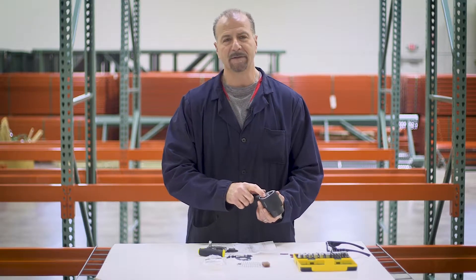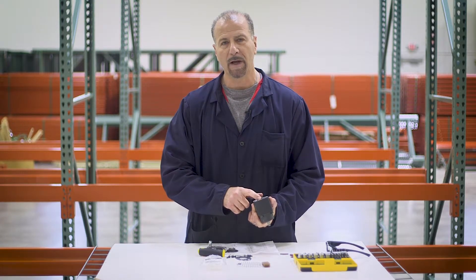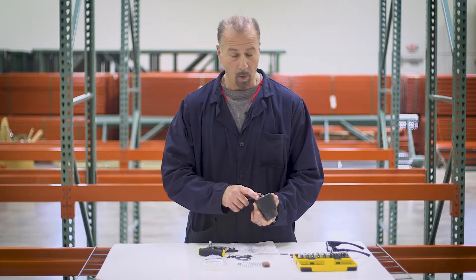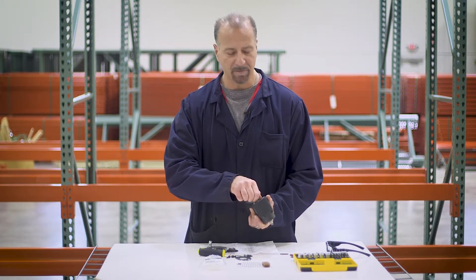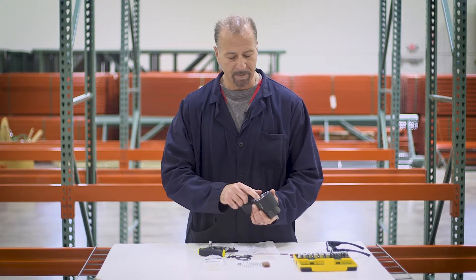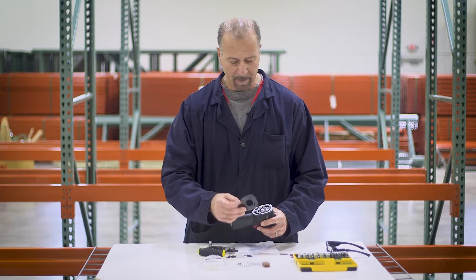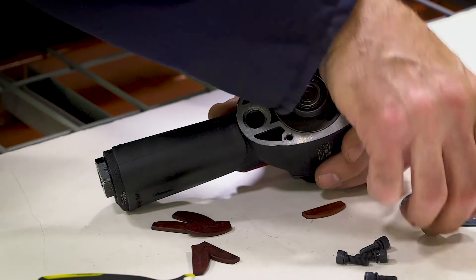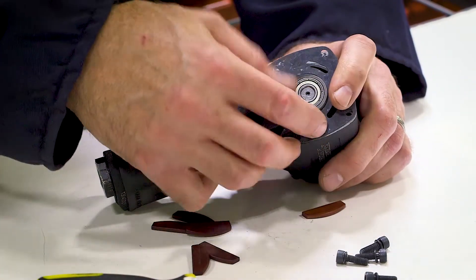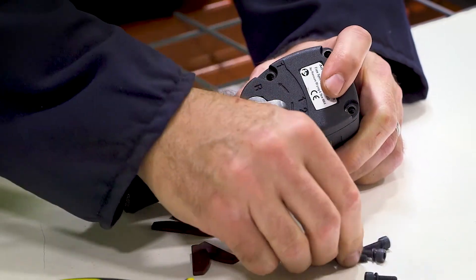One of the things that cause these to go bad is contamination in the air. A really good idea is to put air filters on compressors and to use plenty of air tool oil. A lot of air tool oil contains chemicals to help break up the sludge and varnish that can contaminate these air motor vanes. It's a very simple fix — once you've got that in place, you put your bearing back on, put your fresh gasket to seal it, drop the cover back on, and put your screws in, and you're back in business.